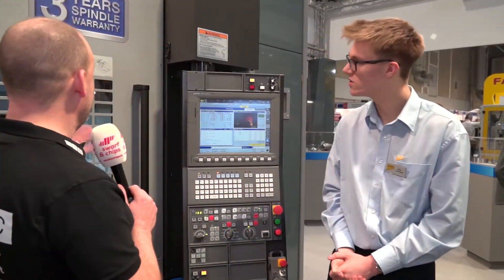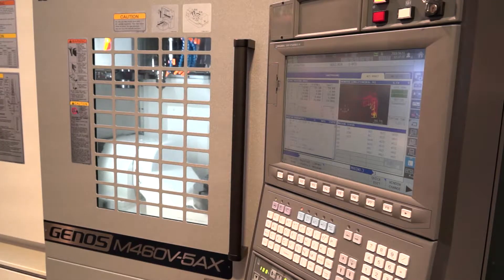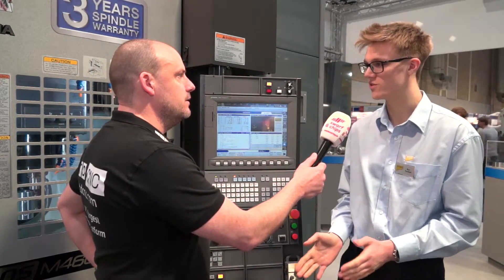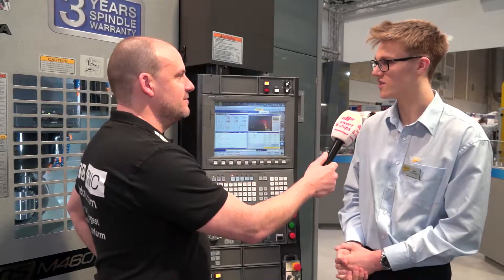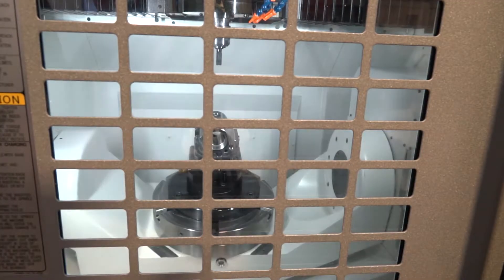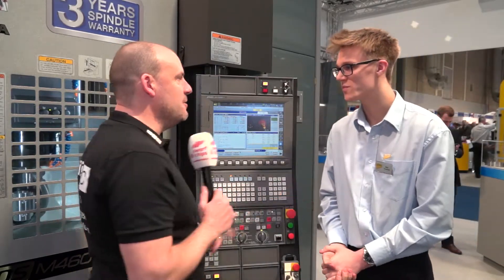One of the things we're going to talk about today is this brand new Okuma Genos M460 5-axis machine. It's very recently been launched - they took it from the original MU model which was made to order and packaged it into this Genos M460, which brings down the price. How would you sell this machine? It's a very sturdy and accurate machine, down to the five-axis auto tuning. It's also very powerful - it's got a 22 kilowatt spindle and 200 Newton metres of torque, so it's able to take big cuts very quickly.